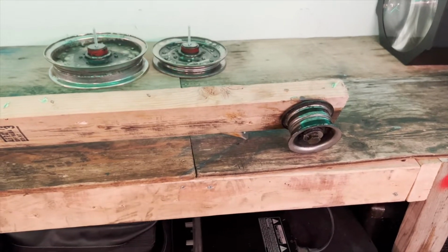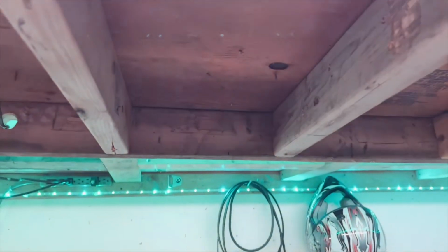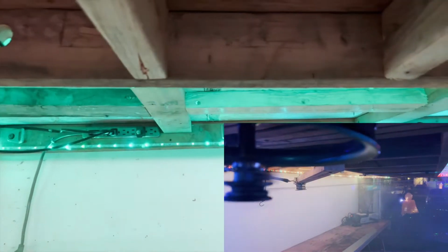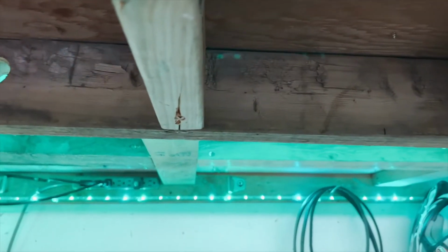All kinds of torque. When first mounting the tensioner arm, I tried to put it in an ideal position relative to the rest of what was going on right here down the middle. And we also had it hard mounted in 2 points at first. So right off the hop, that's a big no-no. You do not want your tensioner arm hard mounted.